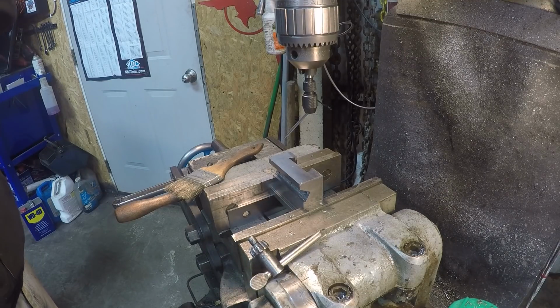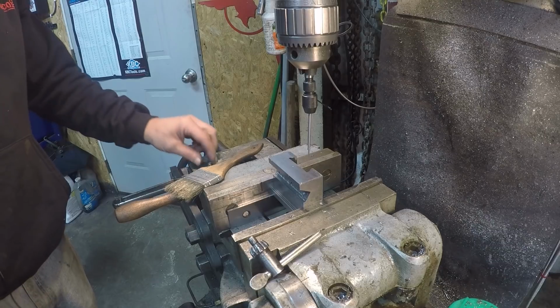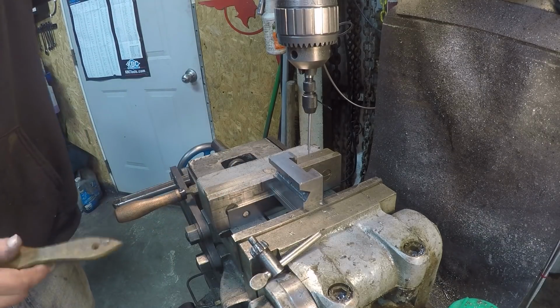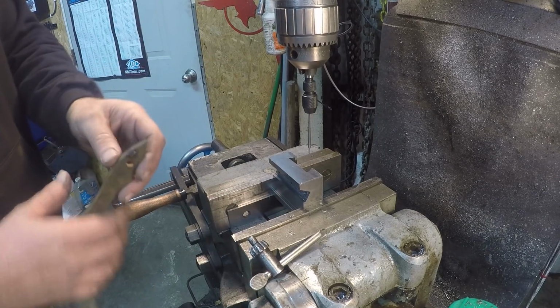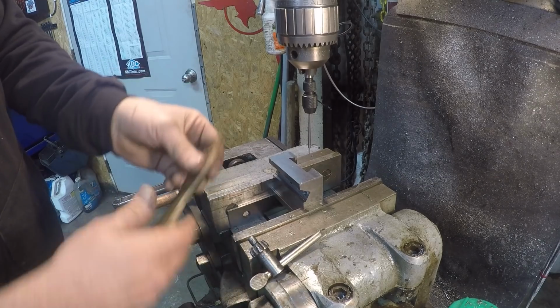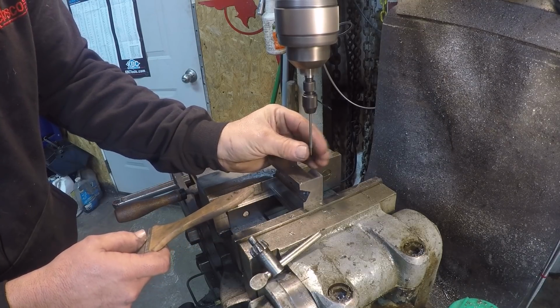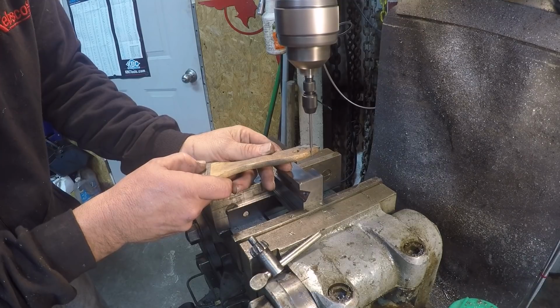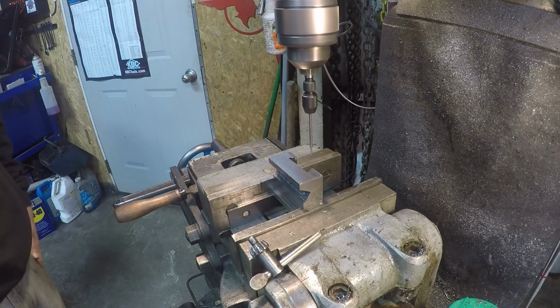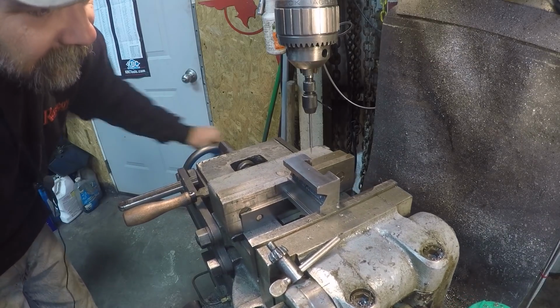I think these things spin best at 1000 RPM or more. I wouldn't take them to some crazy speed, but you know, around 1000. I think the slower you go, the harder they are to stabilize. I've seen a couple people use their fingers to do it. I use a Sharpie or a handle, or a pencil, wood or plastic. You can do it with your fingers, but it's still wiggling. It's just hard to get it to stop. It rubs against that wood, it's oily. Doesn't take any time at all. And you can either shut it off or leave it run.